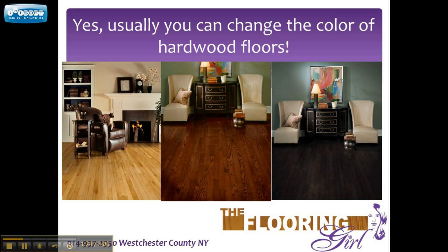This is why it's really important to test the stain colors. It does look different in pictures than it does in real life. The stain colors do actually come out different on everyone's floor. That can vary based on the species — is it red oak or is it white oak? What grade of oak? How old are the floors? As well as the lighting. We always test three or four different stain colors for our customers so they can choose. As you can see in these pictures, some of the planks are lighter, some are darker.